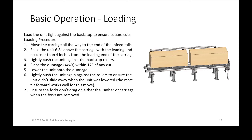with the leading end of the unit no closer than 4 inches from the leading end of the carriage. So you don't want the front of the carriage to be totally flush with the front of the unit, because it causes slight problems with where you're measuring from, because that gear rack that I showed you is only 2 inches from the end. It doesn't go all the way to the very tip because of that lead in. So you're going to hover it above the carriage 6 to 8 inches, and then lightly push the unit against the backstop rollers. When I say lightly, you're just trying to square it up roughly right now,